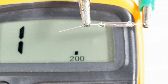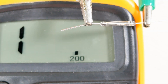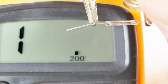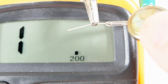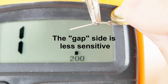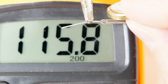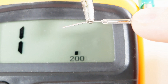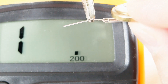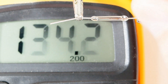Let's look at this in operation. In the background we've got our digital voltmeter set to ohms, and we've just got our magnetic reed switch there. As the magnet approaches, it closes. It does work better in some directions than others — if you approach it from the side, it's not very sensitive, and sometimes one side is more sensitive than the other. It just stuck to my alligator clip. But again, it requires basically zero voltage through the device to make it operate — it'll operate on a hundredth or a thousandth of a volt, whatever you need. It doesn't take anything except the magnetic field, though it can be kind of fussy about the direction it comes from.